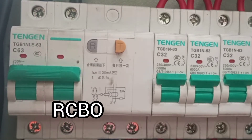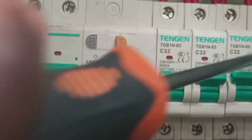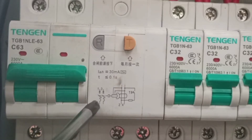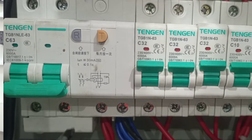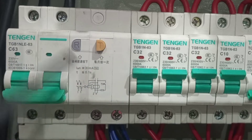As I mentioned earlier, the higher-rated RCBOs are used in an electrical wiring to protect the whole wiring, or to protect a number of circuits in the wiring. It can perform the functions of both an MCB as well as an RCD. So this is an example of an RCBO connected in a circuit to protect all these circuits. This is rated 63 amps, and you can see that it is a type C MCB that is used in this RCBO. We also have the RCD rating here — 30 milliamp. Here is the live input to the RCBO, and this is the neutral input to the RCBO. When we come to the down part, this is the output live terminal, and then this is the output neutral terminal. So this is used as the main breaker for this wiring.